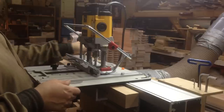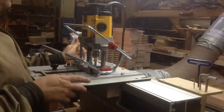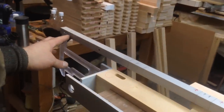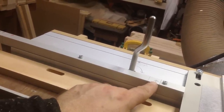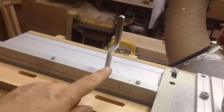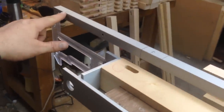I start with the router in this position, over here on this side. I've got the mortises marked out using the cursor. I've got it marked there, there, there, and here. I've also got arrows because there are three different positions that the mortises could be in: one that's in the middle, one that's very close to the edge, and one that's more towards this side. So one arrow for the middle, two red arrows for the outside, and one arrow for towards this side.